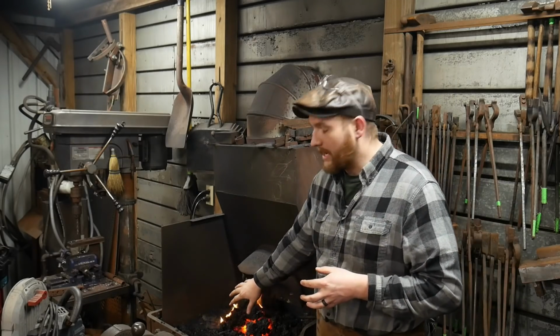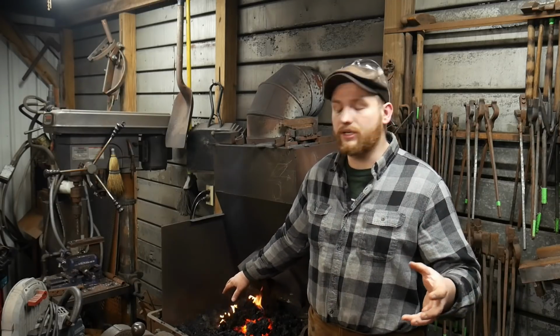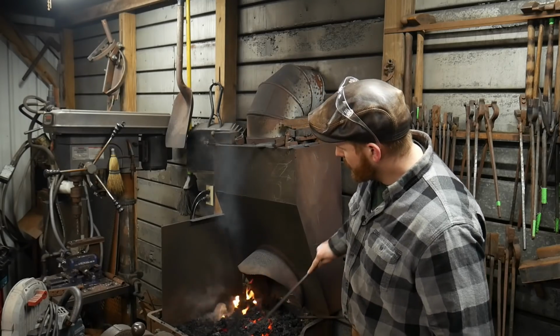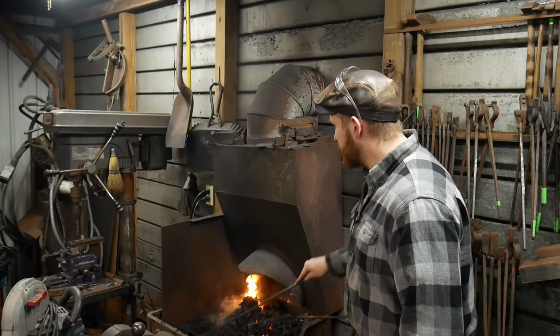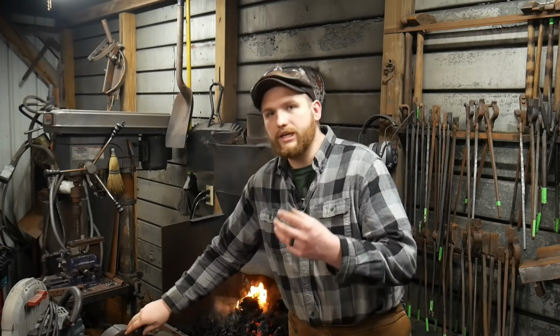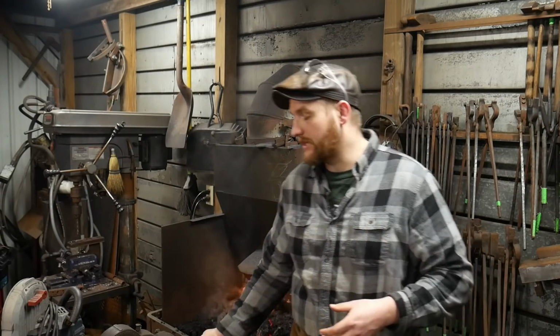So with my coal fire, I like to stove it up at night when I'm ready to go in for the evening. I just break a bunch of green coal over my coke that's already there. What this does is it does not actually burn the coal at all. It bakes that green coal and converts it into breeze. That breeze gets cooked into coke later on in the next morning fire. It gives me starting material for my next fire.